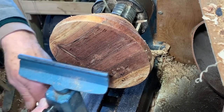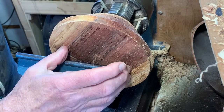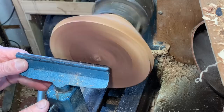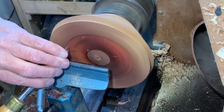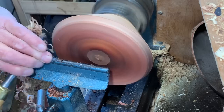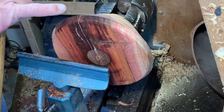So first thing is to get rid of any splits and to make a recess here so that I can rechuck it on the chuck. So just get some of the inside out. Half inch spindle gouge. There's a clean cut up on the edge there so I can see along the pith where the splits are,